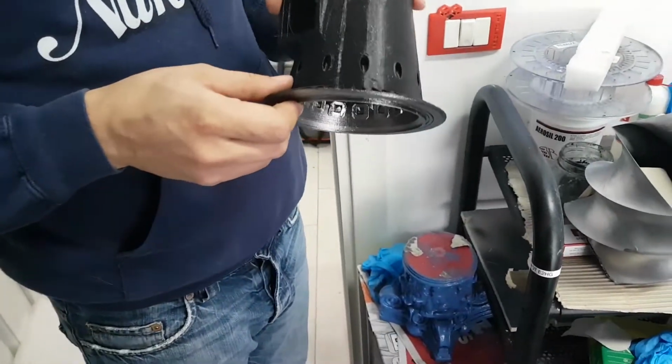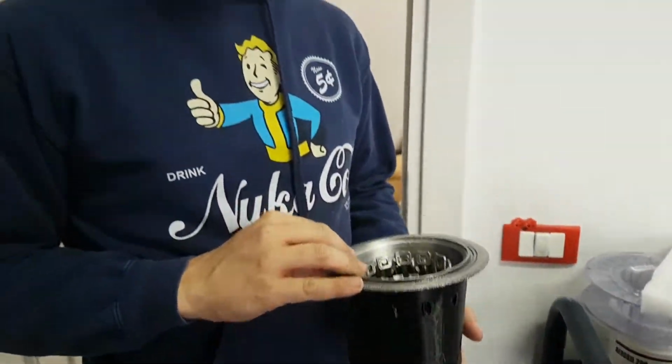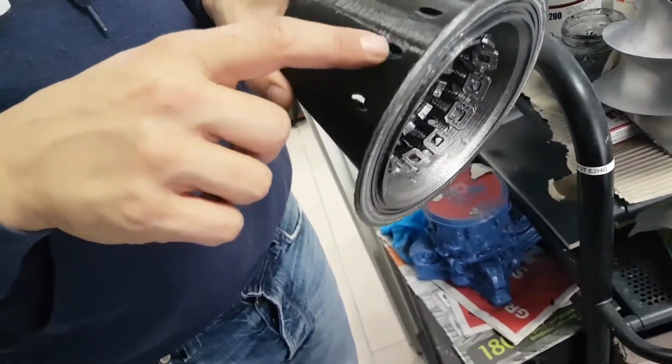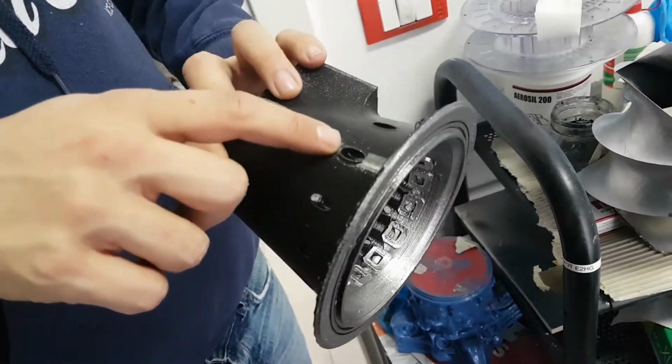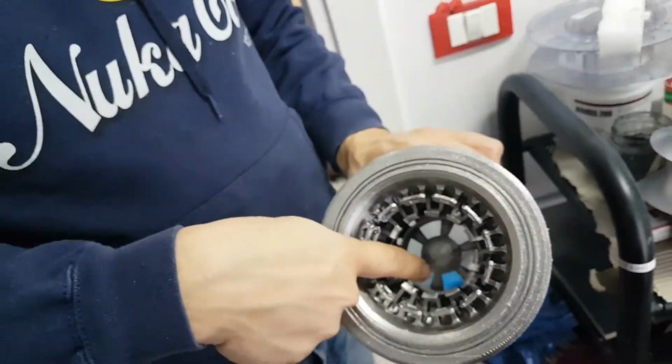Also we cannot use heat stuff with PLA. It could melt quite easily, already at 65 degrees it could start bending from the heat. So we will use something different. We will use white and blue LEDs inside those little holes that are all pointing toward the center.